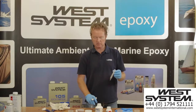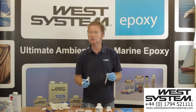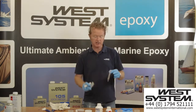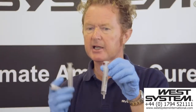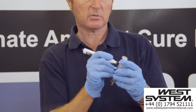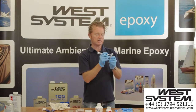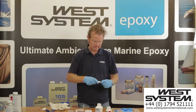It's very important to mix the West System resin and hardener at a 5:1 ratio. You can do that by weight or volume. So small weighing scales are fine, but for very small amounts, these syringes that are supplied in the mini pack are perfect. But it's a very good idea to mark each one with an R for resin and an H for hardener, so they don't get cross-contaminated.